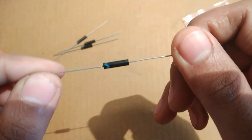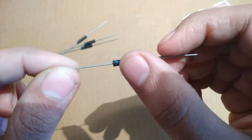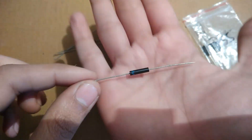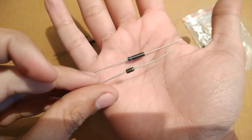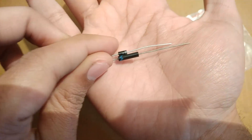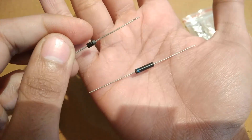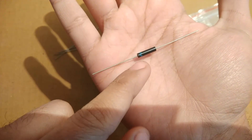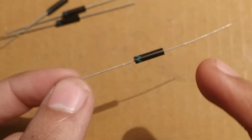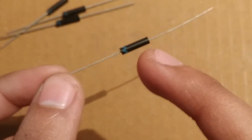As you can see, these diodes are longer than normal diodes, and instead of a silver line they have a blue zigzag line indicating the negative — the back side is obviously the positive. Comparing with a normal diode, the negative is indicated by the silver line and it is smaller in length. The maximum reverse voltage of the normal diode is around 400 volts, while this high voltage diode is rated at 20,000 volts. Judging from its length, it's like many small signal diodes connected in series to create a large reverse voltage value.